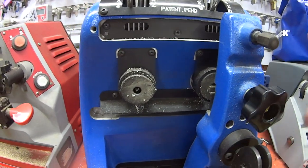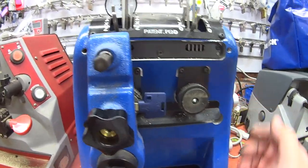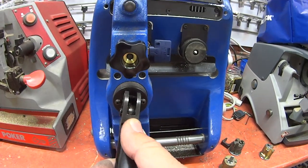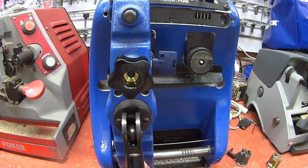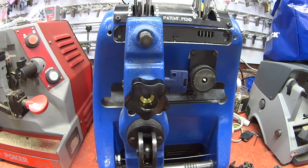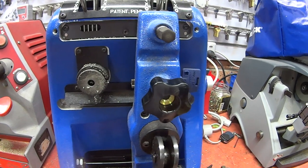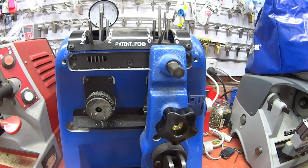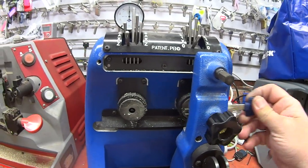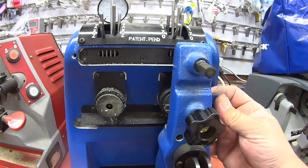With the key loaded, turn the machine on and start the cut. When I cut I lift this up once, twice, then move on. The second cut I skip. Third cut I move up. Moving over to the inners: first cut, skip second, move to third, up, and down until I've completed the key. Once completed, I remove it, rotate it, reinsert it, and do that side.